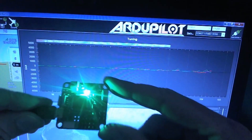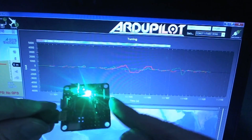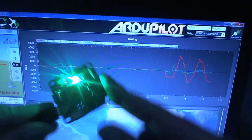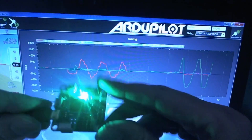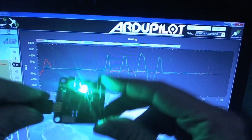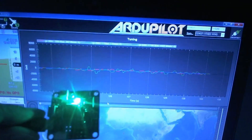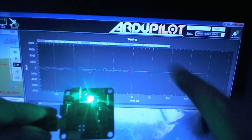Here we're looking at a display of the gyroscope output. If I rotate the board yaw-wise, we get large red values. If I rotate it this way — whatever that would be — we get large green values. And if I rotate it in the third axis, we get nothing. The blue line there is just stuck at zero the whole way.